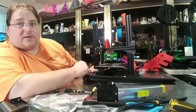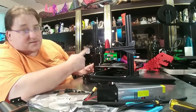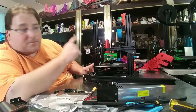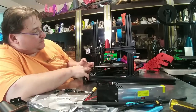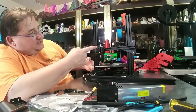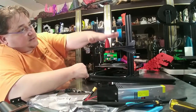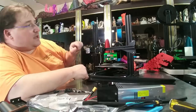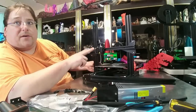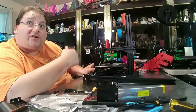The vertical gantries are installed and the X-axis trolleys are installed. The way to tell this is installed correctly — check it with the top installed. Put your finger on the coupler and rotate it back and forth; you'll see the printer moves up and down. As it moves, pay attention to the other side. If that side lags behind instead of moving together, it's too tight and you need to loosen it. Make sure both sides move together freely. If they don't move together freely, you'll never get the bed level — the bed level will change every time you print.